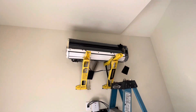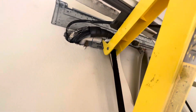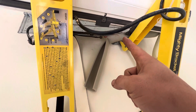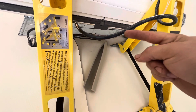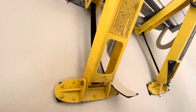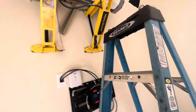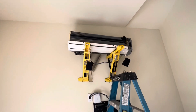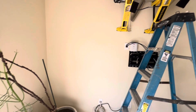Everything is back up there. Got the system under pressure at 350 psi. You can see I started wrapping it up there and left it right there. What I usually do is cut that insulation right around there, maybe a little bit further back, and just keep using the insulation tape tighter. As you can see, it ends up tighter and thinner than Armaflex. I'm going to leave it here for 15 to 20 minutes to make sure the pressure doesn't drop. I don't hear anything — I'm going to get up there and put some soapy bubbles and see what's up.